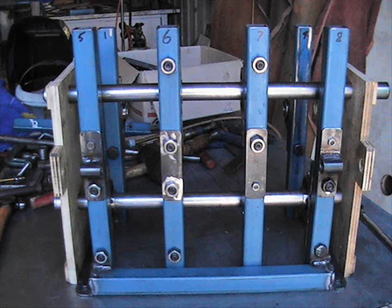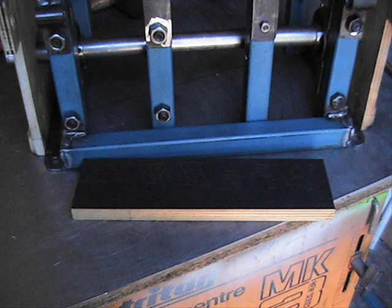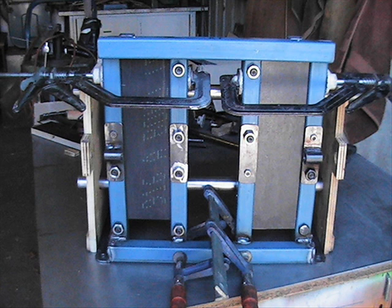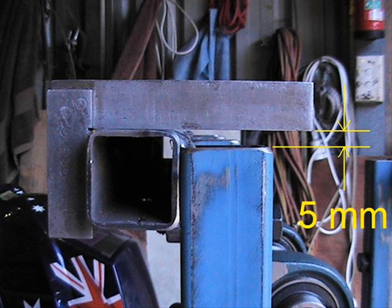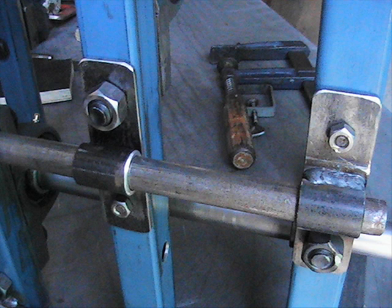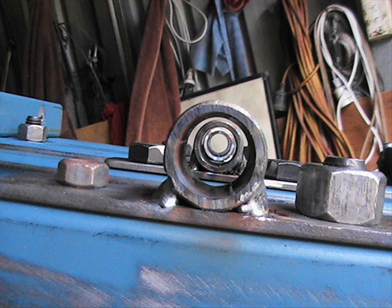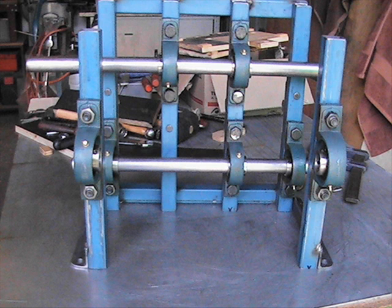Step two: first, remove the shafts and jigs and place posts 6 and 7 with the corresponding bearing blocks and trunnion plates in place. The bearing collars now face away from the center. Next, insert the 1 inch shafts through the bearings with the jigs located to the outside of the frame. To get the correct spacings for posts 6 and 7, cut two pieces at 81 millimetres wide and clamp the posts in place, along with the rear top horizontal brace with the holes uppermost, located 5 millimetres above the height of the posts. These can now be welded in place. Next, place your 5/8 shaft with the trunnion sleeves in location as you did before and weld in place. Make certain both sides of the sleeve are welded firm before you remove the shaft, to ensure a true alignment.